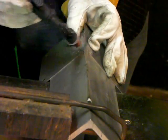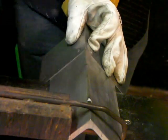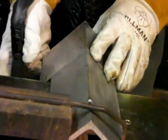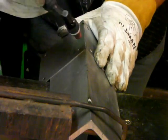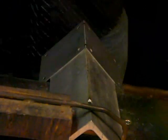When you're tacking a joint like this — just fusion tacking stainless steel — you can set the machine roughly twice as hot as what you think you're going to weld with. You touch off with that tungsten, rock back, and just bump that pedal real quick to give it a little blast of amperage. It usually drives those things together so quick it's almost like a laser, and it won't heat up, warp, or blow a hole. Rock the cup in, touch the tip off, rock it back — even without looking I can do it — hit it real quick with the foot pedal and you get a nice clean small tack.